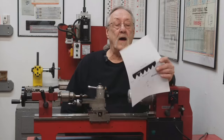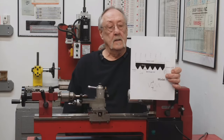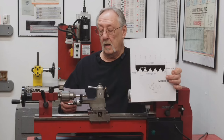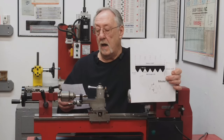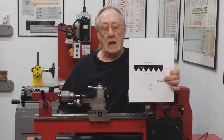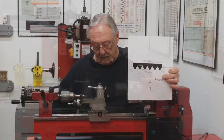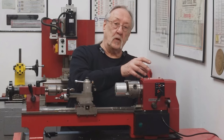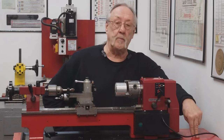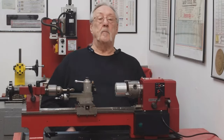This is a profile printout of the type of belt that I want to use. Let's see, what is it called? I have it written down here. It's called a 6-ribbed PJ V belt with 40 degree V ribs. That would be these here. And like I said, I'm gonna start with this pulley, go down to a shaft, shaft's moving over, going down through the base. I'm doing one step at a time. Pulleys first, shaft next, pillow blocks.